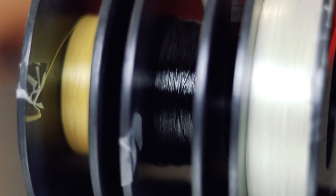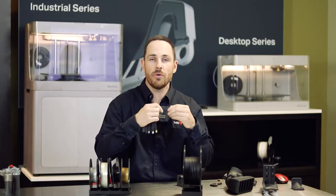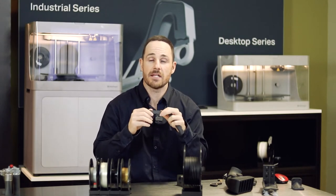Now we continue with the carbon fiber — this is your continuous strand of carbon fiber. When you lay out your onyx, you have the choice. You can create a part with onyx alone, which will give you a certain flexibility due to the nylon base and great abrasion resistance. Now with our continuous strand of carbon fiber, you can really reinforce your part. For people who want to understand the strength, this goes beyond aircraft aluminum — you can create a part that is as strong as 7075 aluminum. So we're looking at fully functional parts.